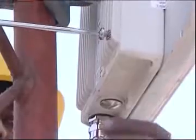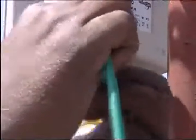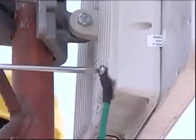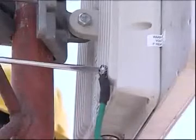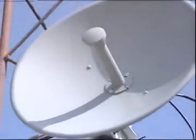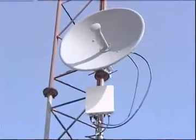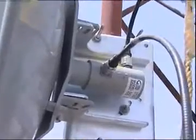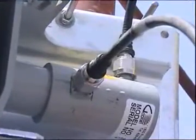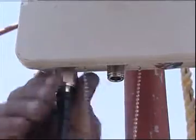Now follow the process of grounding. All Radwin products should be grounded during operation. There is a dedicated nut or lugs available in the IDU and ODU for this purpose, which must be properly grounded before powering up the system. If you are using an ODU with an external antenna, follow the mounting instructions supplied with the product. The RF cables between the ODU and antenna should be properly crimped, terminated, and weatherproofed.